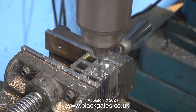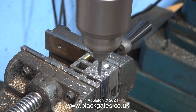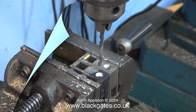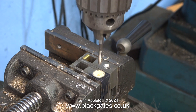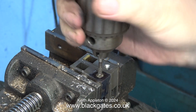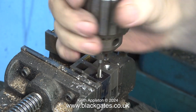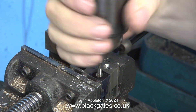I do like to show non-engineering methods — there are usually several ways to approach many jobs in my workshop. In this case, as usual, I'm using my calibrated eye. For some reason these crossheads have been built using four pieces of metal, which is not the way it's shown on the drawing, but they seem to work okay. Here I'm injecting some cutting lubricant into the hole and threading it using a 2BA tap. It's really important to start the tap off in the hole perfectly square to the work — if you don't, the deeper you get the more it will wander off. But I really don't want to use the drilling machine's chuck to go all the way through.